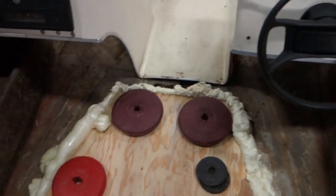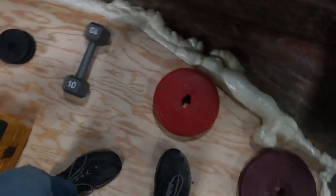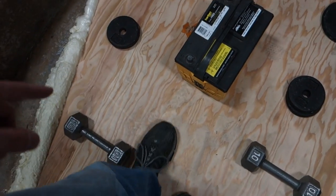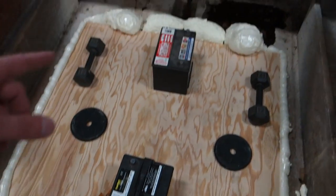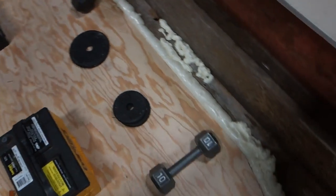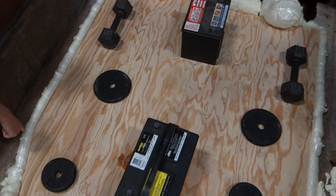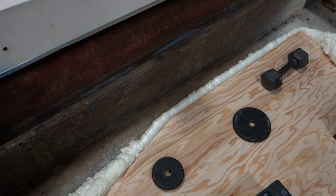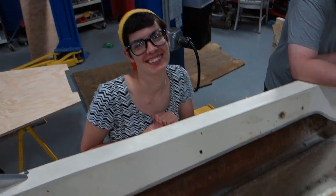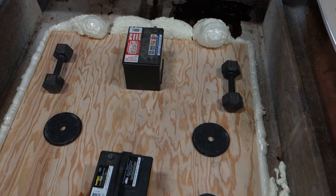Well, that's boat progress for the day. We got both new floors cut, anchors in for the seats. And this is just going to sit here with weight on it. It's glued down with liquid nails, and I filled every single bit I could with Great Stuff. Every nook and cranny. The plan is tomorrow. Don't touch it! It'll foam out and do its thing.